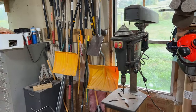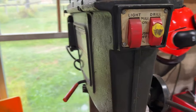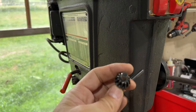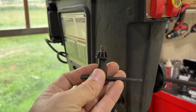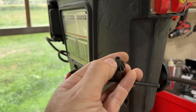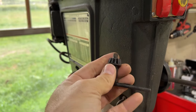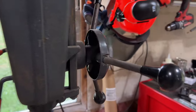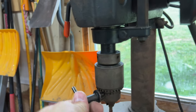So that's it. Now, one thing that was a little bit annoying, you didn't have a chuck key. So I have one here. Sometimes you get these cheap ones on Amazon. I'll link to this one in the description. It's real cheap, but I did have to hit this with a grinder just a hair, because they coat this entire thing, and when they coat it, it adds a little bit, and then you can't get it in here. But now it's real nice.